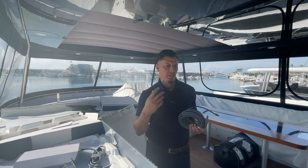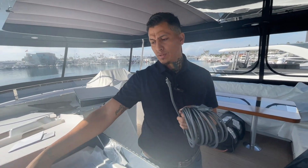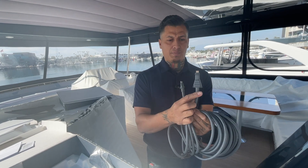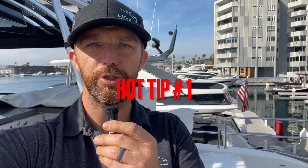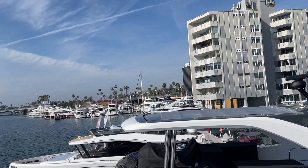When running your cable from the fly bridge or wherever you're mounting, you want to start where the cable plugs in and run it down — because of the size of the holes you'd have to cut, you run down rather than up. My first hot tip: make sure you have enough cable to run from the mounting point all the way down to your connection point in the main salon.